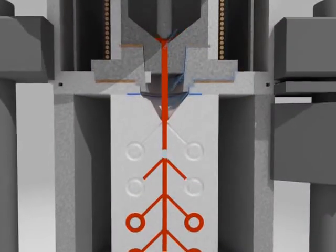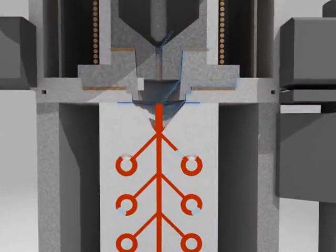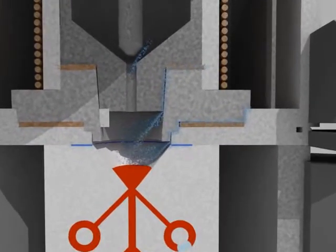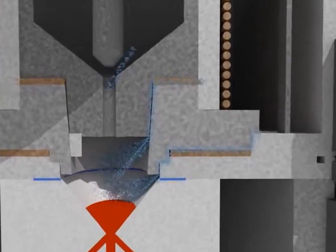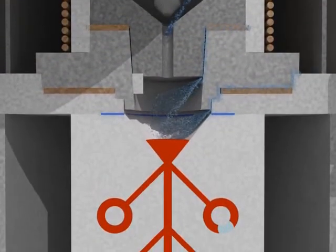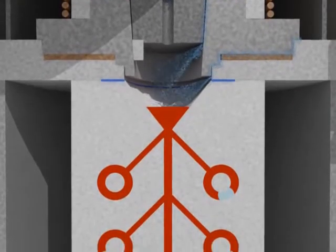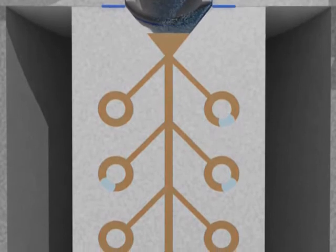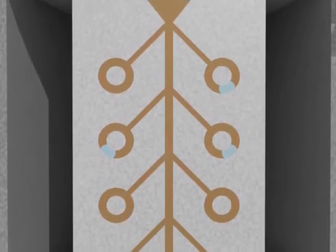But when the crucible gasket and sealing are worn, after a few castings, the gas pressure goes through the crucible ceramic holder and it's absorbed by the metal. This phenomenon, together with the metal injection speed, creates gaseous formations, which cause improper filling, damage to the investment and rough surfaces, as in the old centrifugal systems abandoned a long time ago for the casting of gold and silver.